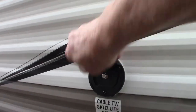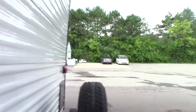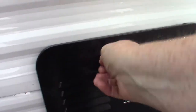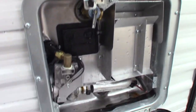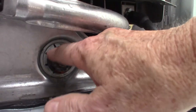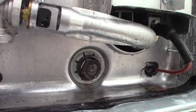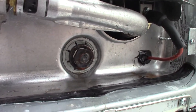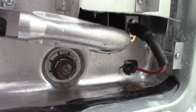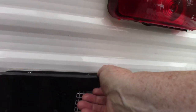This is just cable and satellite hookup which is coax. Your water heater controls are inside — it works on gas. This is where you drain it: it's an inch and a sixteenth six-point socket, and you'll need an extension to operate your ratchet. The switch to turn it on and off is inside the trailer.